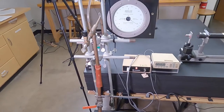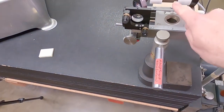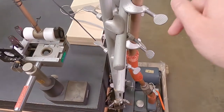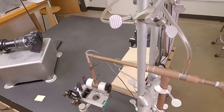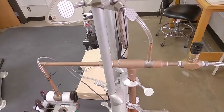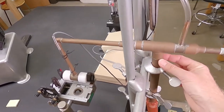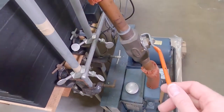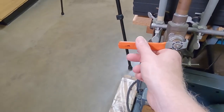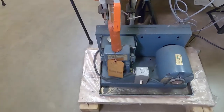I'm going to turn on the vacuum pump and pump air out. This is a cell with clear glass front and back, otherwise the light wouldn't go through. This tube goes to the device that measures the pressure. This branch goes to a valve which I can turn to slowly let air back in. Right now I'm going to close the valve by tightening the screw so no air can come back in. This branch goes to another valve — when the valves are crossed, the valve is closed; when parallel to the line, the valve is open. Let me turn on the vacuum pump and watch the pressure go down.